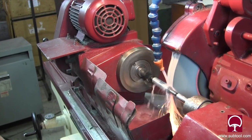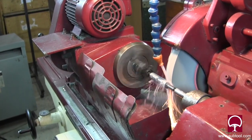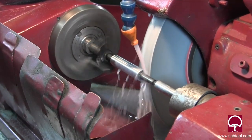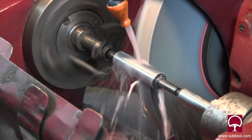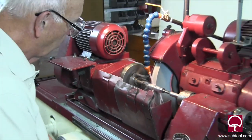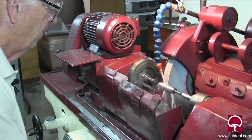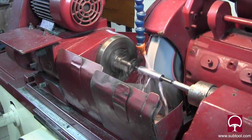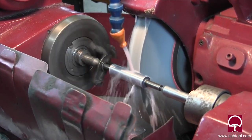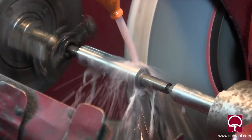You can take one pass to take the majority of the stock off, then go back and take another pass to finish it up — maybe two passes, it just depends. We've already gotten the taper out of the machine, so we know that's good. If I were going to completely finish this, I would have it roughed in, go do the smaller diameters next, then come back and finish it. We'll feed in just a little bit and take one more pass. By the sparks, we're not taking hardly anything off — I call that counting sparks. We're probably taking three or four tenths. We'll take the mic and give it a check, and take our finish pass if necessary.